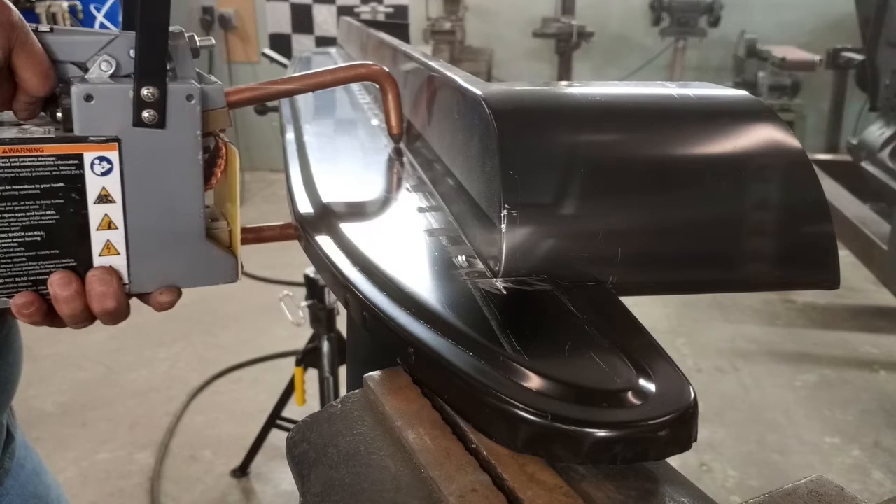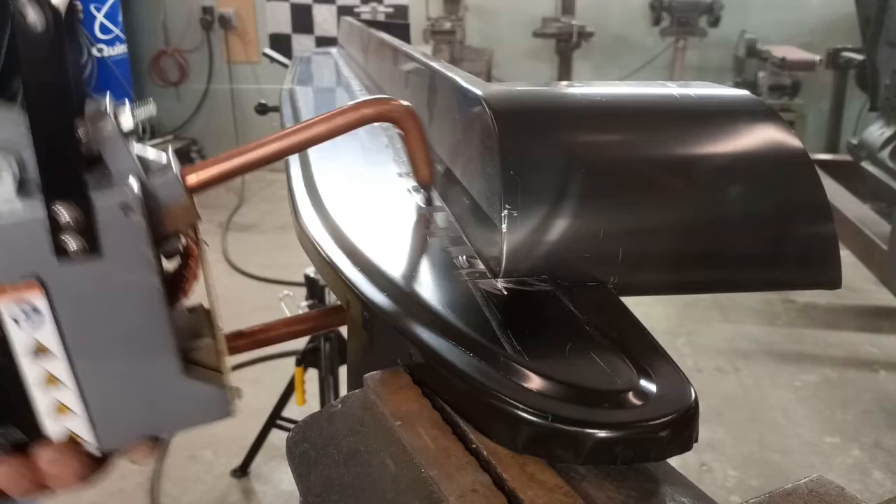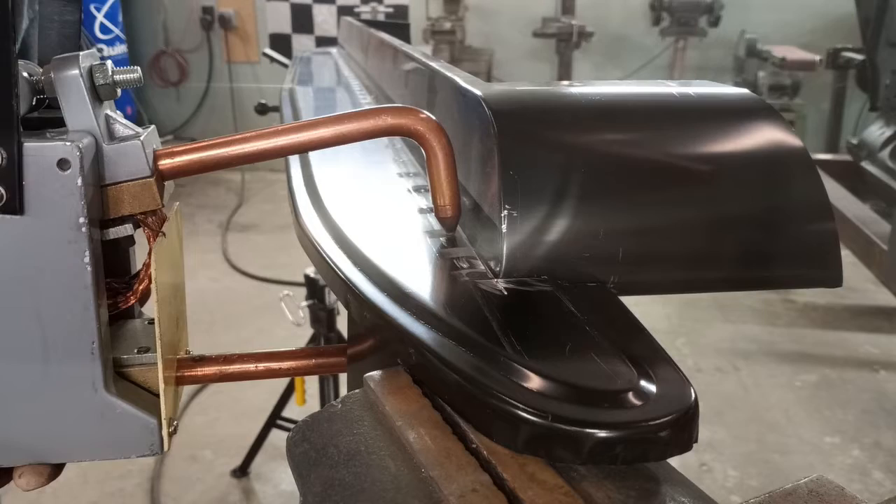Here's a better shot. On the home stretch — let's clamp and activate. You'll see it turn cherry red for a second, and that's when you want to stop. You always want to wear goggles or a face shield, because sometimes it throws off a lot of sparks.